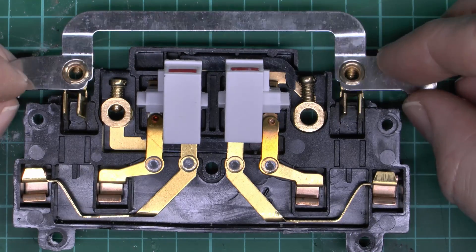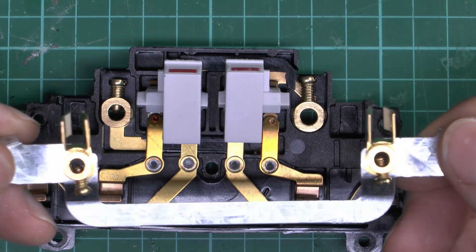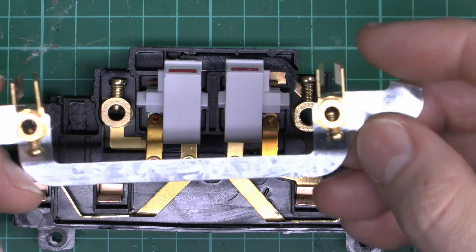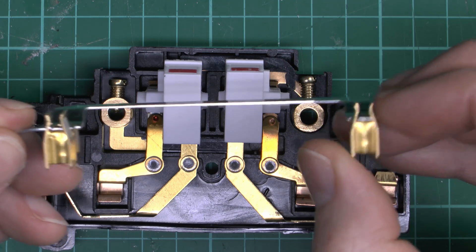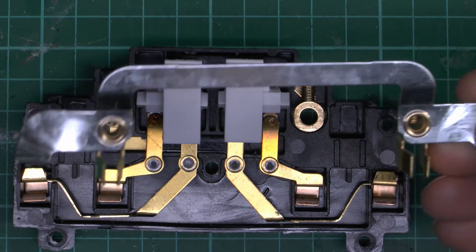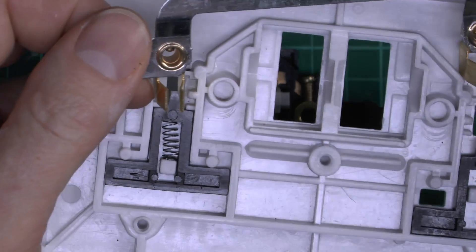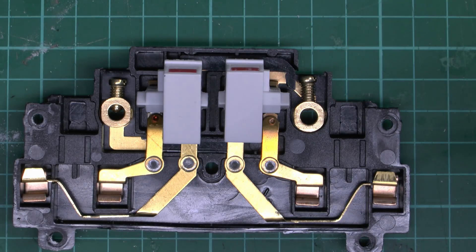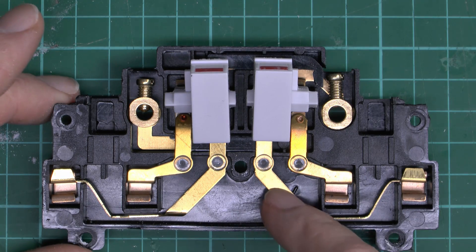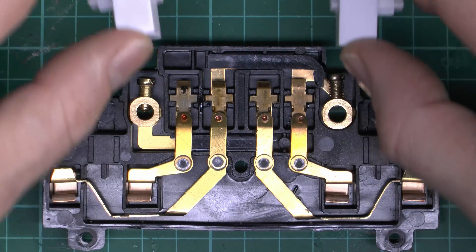Now in terms of the earth bar, that does appear to be detachable, so that's essentially the two earth terminals on the back. That also forms part of the things where the earth pin would go in — that's basically the actual contact there. And as we saw, that did go down to the actual holes on the side, so that when you put the screws through to connect to the back box, that one is actually connected to earth, unlike that pile of junk we saw in a previous one. And inside there we've got the actual bars come across to the line and neutral holes, and we've got our two switches on the top.